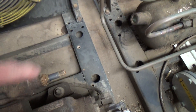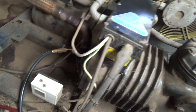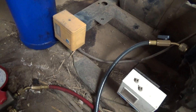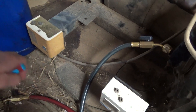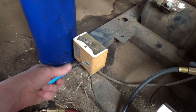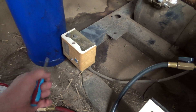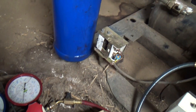I can still hear that leaking. Got the receiver valve shut, suction valve engaged on. Got the cap off — once we've pumped it down we'll shut that valve in, just in case the head leaks.